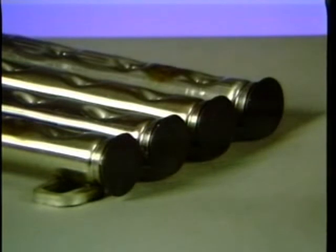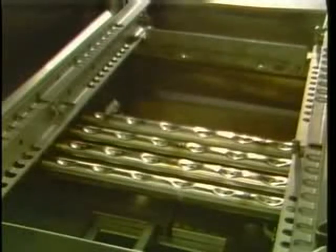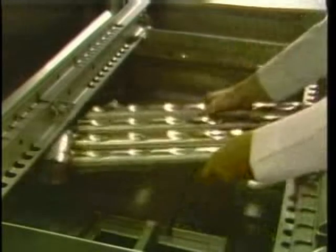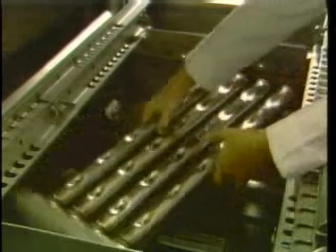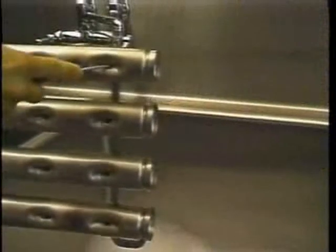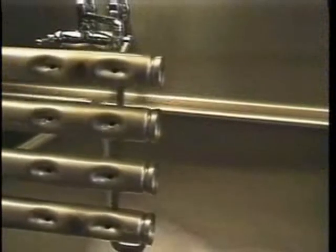If the end plugs are missing, you must replace them. If the wash arm nozzles are clogged, remove the wash arms as explained earlier. Take the wash arm to the sink for cleaning. Remove the end plugs. Using a table knife or a similar object, push the obstruction from the wash arm.